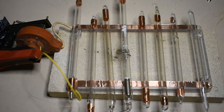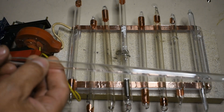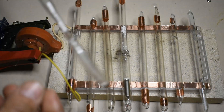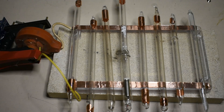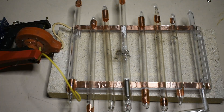This is another little short video — I've been having a bit of fun with this stuff. This is the tubing for neon sign manufacturing. I've been sealing off one end and sealing the second end once it's vacuumed down and some gas has been put in it. So I've got a selection here of sealed tubes.